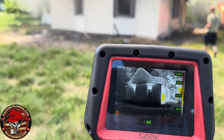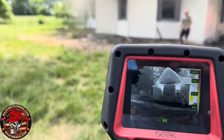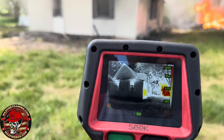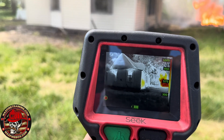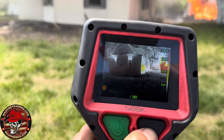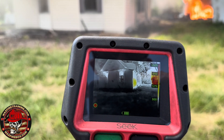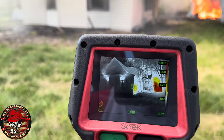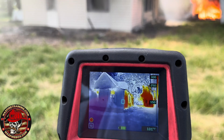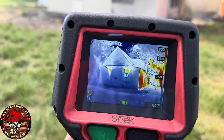We're taking a look here and as we're looking, we're sizing this up. We're going to change it back to survey mode to show the power of showing color at 150 whenever you're doing that sizing. Here we go — one, two. We're going to hold it for about two seconds. Now we're in temperature mode. We know we never focus on spot temperature. Now let's go to survey mode — boom! There we are. Survey mode, showing the value of survey mode.